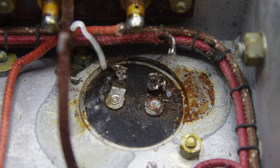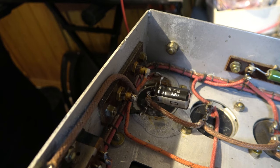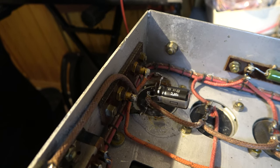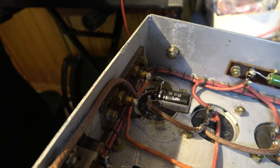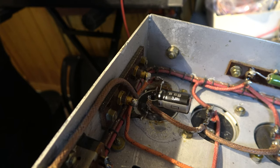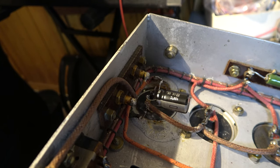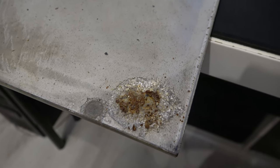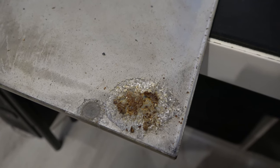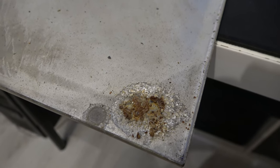So while investigating the hum, I decided to bypass this leaky cap and put in a modern 400 volt 15UF cap, and it has reduced the hum quite a bit. So that's good. It does make me suspect that the other caps are responsible for some of the background hum also - and really they're ancient, although reformed. So you can see this area of discoloration and rust and contamination - this is probably from the capacitor that leaked. It's in the same corner beneath the capacitor. Electrolyte has dropped onto the base plate here and caused this.